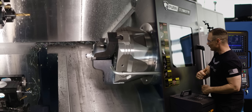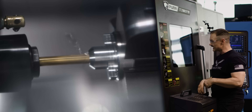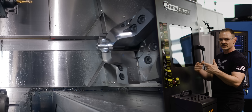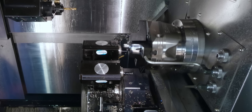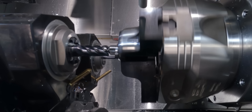Now we're switching to the upper turret to drill. This really shows the versatility of the machine — I can use the upper turret on the left or right, and I can use the lower turret on the left or right. We're coming in with the Harvey TE1 quarter-inch end mill again, which allows us to get into those tight corners on the finish profile.